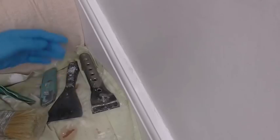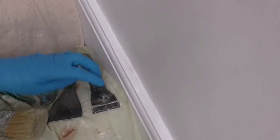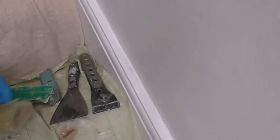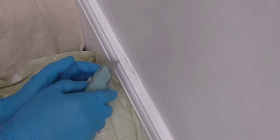I've put a sheet down to help clean up between stages a little bit quicker. I've got my paint scraper, which I'm hoping not to use, a Stanley knife, a 120-grit which I'm going to use on the rougher edges, a duster brush, and I'll be using 180 on the woodwork generally. First of all, have a look at what's going on — I've started by loosening off what is here and doing a bit of investigating. Generally it's going to be caused by shock — the tread hitting the stringing — and you can hear it's quite hollow.